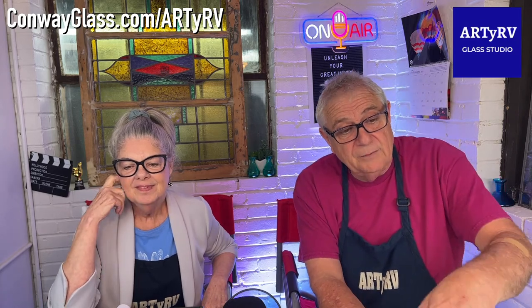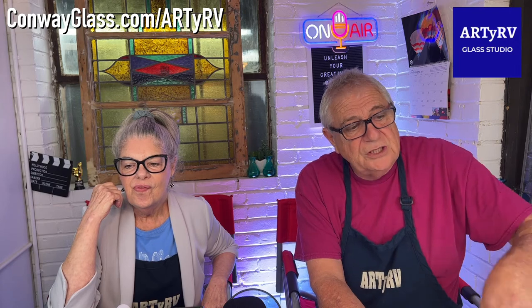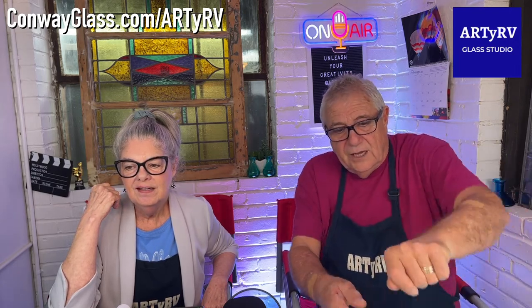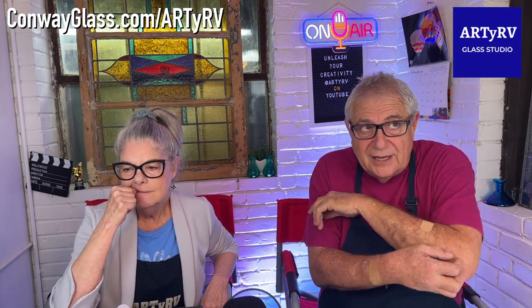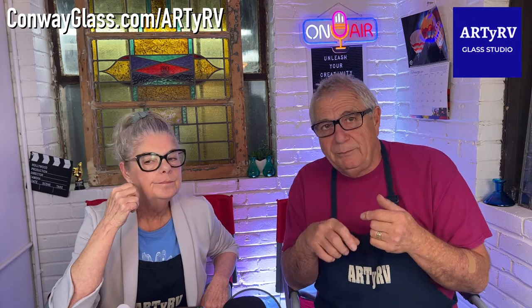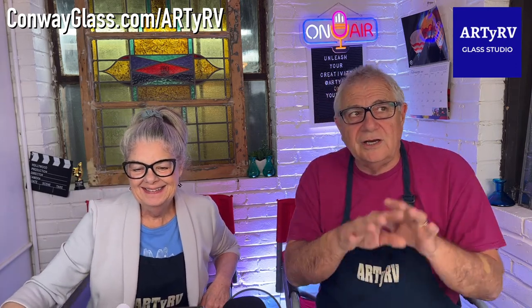And then you're going to want to come back. If you're glazing your window in a circular motion and glazing the edges like this, holding on to the lead, pushing it all in, it's going to be glazed correctly. So you want to take some time. Glazing is not a fast process. But the one thing you don't have to do is let the putty cook. There's no cooking about it.